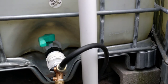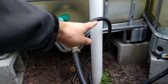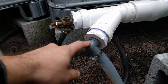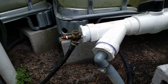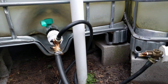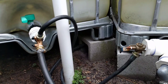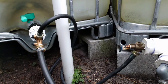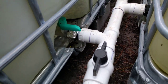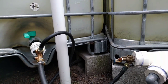The output is something very unique to the end user — plan that ahead of time: how many outputs you need, where you're going to be using the water, what it's going to be used for. I have one tank separated and isolated for the pond, which is slowly fed by the other eight. One line goes toward the pond and one goes to the garden; the garden gets the majority of the water, and the pond gets a slow trickle for the river effect and water renewal for the fish. I also have an outside spigot so I can drain from the tanks manually. Plan those things ahead of time because once the system is built it can be difficult to alter — especially in PVC, you'll have to cut and trim.